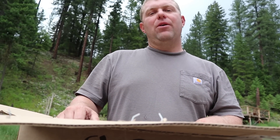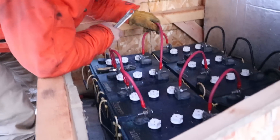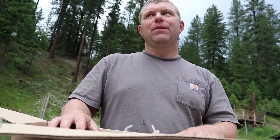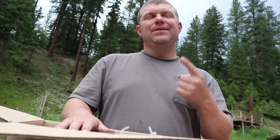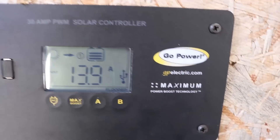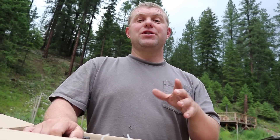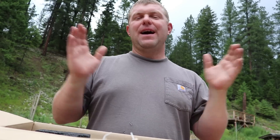We've been living off-grid for about two years now and we've had a full battery bank - used, but we did a video on it. That system has been working okay, but the thing is it's really designed for an RV. We've got a couple of major problems: one, it's just too small at 480 watts max with a single charge controller - not enough for what we're doing because we've got a stand-up freezer. The other major problem is the distance of the panels from our charge controller.